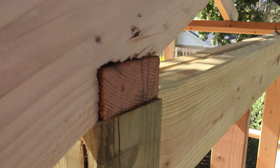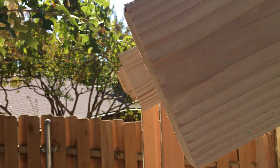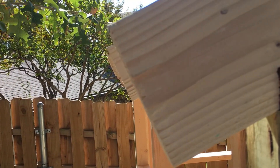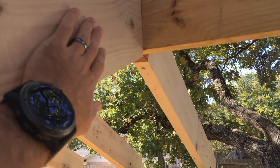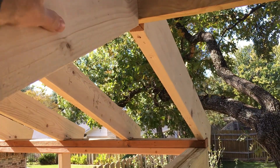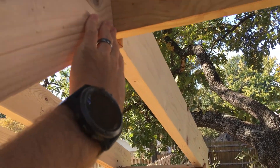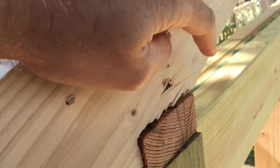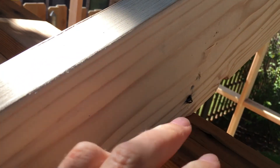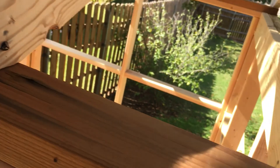You can see the results of the frame here. We've got our first bird's mouth cut. You can see the top of the top plate — the way we cut this, it's almost perfectly straight. We just did one cut for each rafter side, taking a piece of 2x6x8 lumber and cutting it in half at an angle to create the top cut. There's a screw here, and you can see how it's been toenailed in on both sides. We'll probably add a hurricane strap here just to secure it.